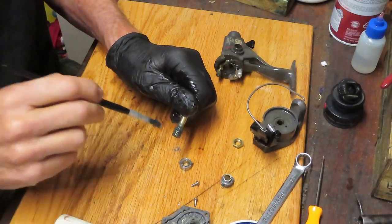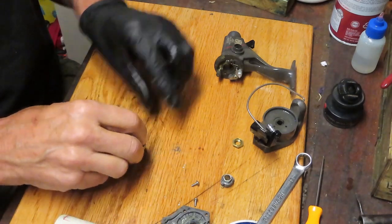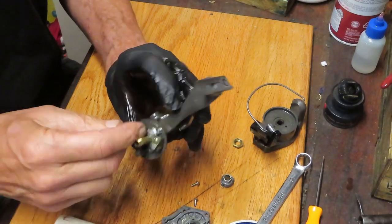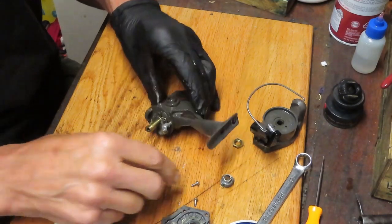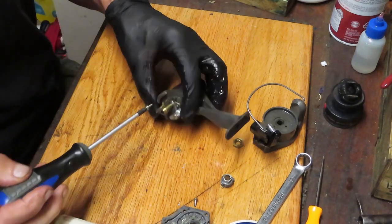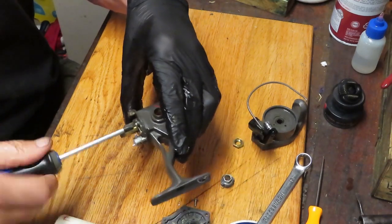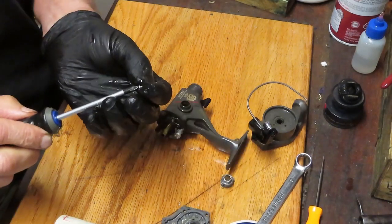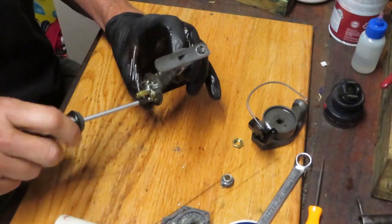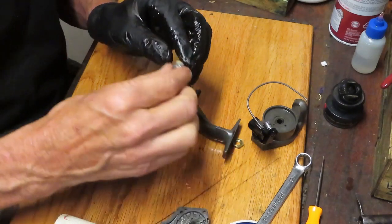A little bit on top of that because that's the inner race of the bearing. Grab your bearing, place that on there, put the whole piece back into the assembly. Make sure that your bearing seats flush to the rim of the case, and then take those two collar screws, one on each side, to hold that assembly in place. That's the upper end, with the exception of reinstalling the single stop and setting it for the proper position.